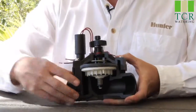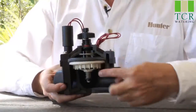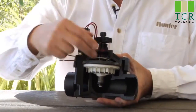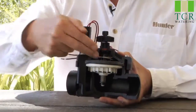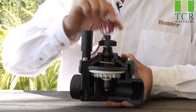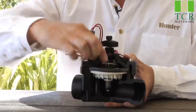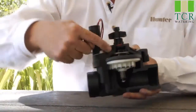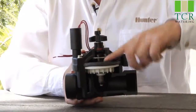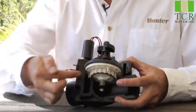The top portion of the valve has something called a bonnet chamber, and you can see that inside here. At idle, the diaphragm sits down on the diaphragm seat. There's no escape of water on top, so it's pressurized — the plunger is down and not allowing water to escape. When the controller turns on the valve electrically, the plunger raises up, and the pressure and water on top of the diaphragm is allowed to escape down the exhaust port downstream. Once that water escapes, the pressure drops and allows the diaphragm to move upward off its seat, allowing water to escape downstream to the heads.